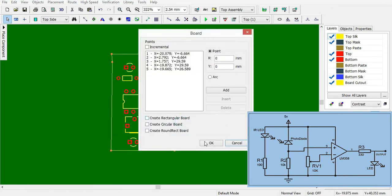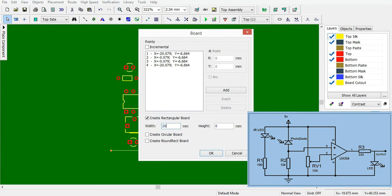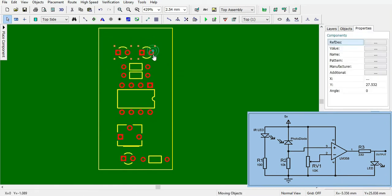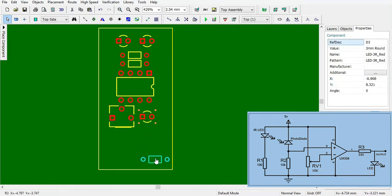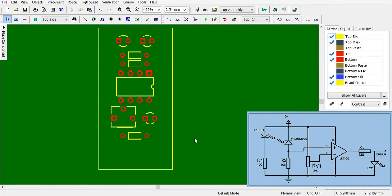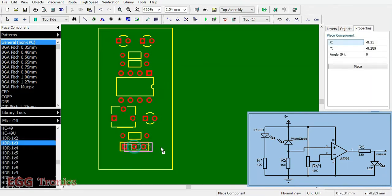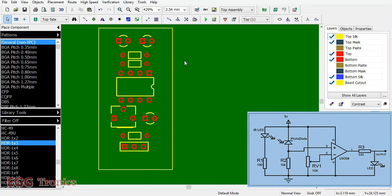Let's create a rectangular board of width around 20 mm by 40 mm — slightly larger than the reference infrared sensor — and then we can make it more compact later. Let's place the components as close as possible, referring to the circuit diagram. We also need one more component: the three-pin header at the bottom of the infrared sensor. We'll go to the general library, then headers, and add it. Now all the components are at their place.